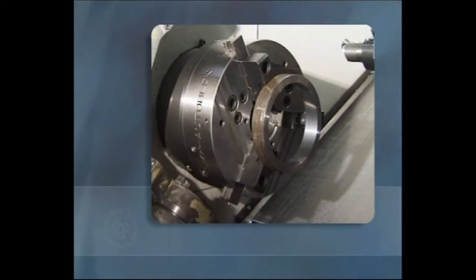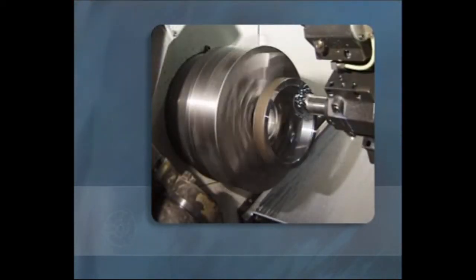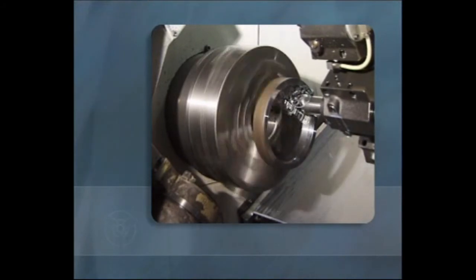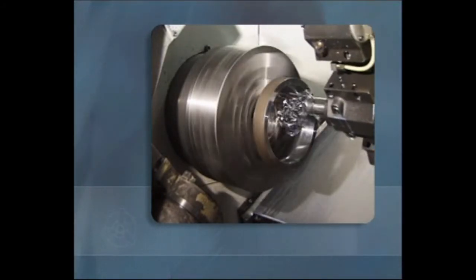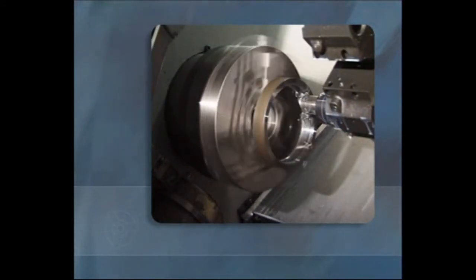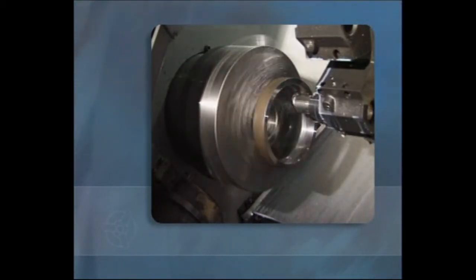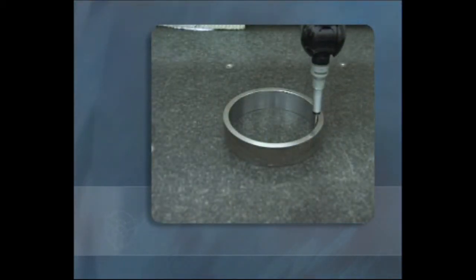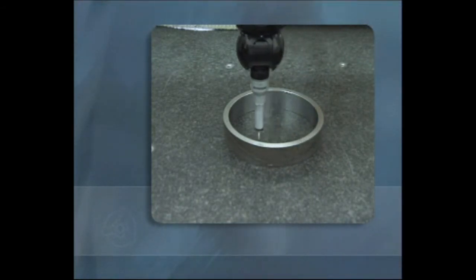Clamping a bearing ring with total clamping force of only about 100 kg. Because of the keyed fit, greater clamping forces are not needed. In the future, the large clamping cylinders can be replaced by smaller ones. Secure clamping is achieved by means of the defined indentation only 0.5 mm in depth. By using Ino-Grip clamping jaws in the first operation, concentricity errors are considerably reduced compared to traditional equipment. Tolerances for H7 qualities and higher are possible, depending on the processing techniques used.